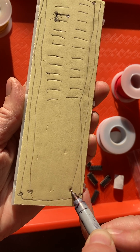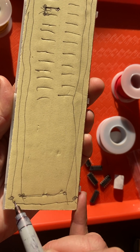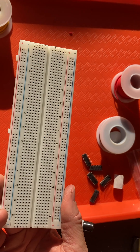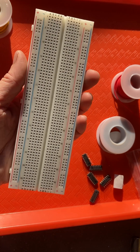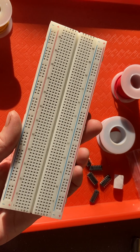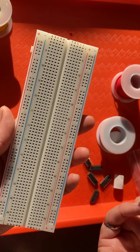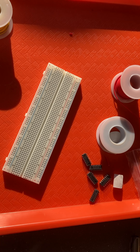If you connect one side to positive and the other to negative and wire to both sides of the board, you're going to have to jumper positive to positive and negative to negative with an actual wire — that's one of the common things we do. Also, a breadboard has an up and a down position. When you hold your breadboard right side up it reads A, B, C, D, E — upside down it reads J, I, H, which is not in alphabetical order, so always hold it right side up.